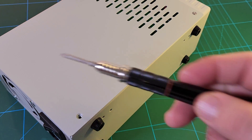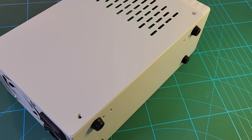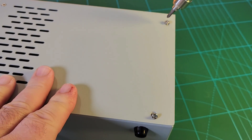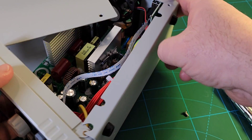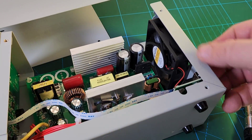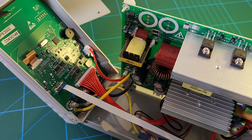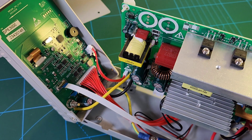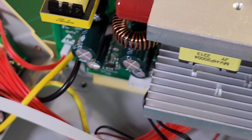Time to see what's going on inside this power supply — four Phillips screws on each side, total of eight to get inside. Taking off that top... very, very nice. We have threaded inserts on the front side of that control board. The PCB is labeled SPE 3000 YW, SPE 3051 CPV version 1.22, with a fab date of February 6th, 2023. There are programmable inputs for factory calibration. Nice wiring here — just first impression, it looks very sweet.